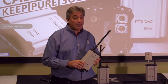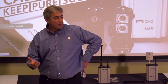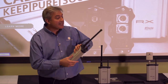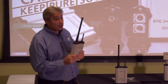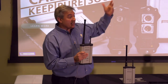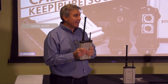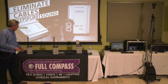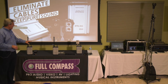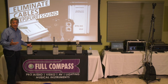Obviously this is not something you're going to be running around the stage with — the guitar player would impale himself. This is designed to be installed, whether permanent or temporary. It's designed to be mounted to something: truss work, a speaker stand with a long telescoping arm, a wall. We have three signal types, and we're running at five gigahertz for the audio. We also have a second antenna running at 2.4 gigahertz for setup, monitoring, and control.